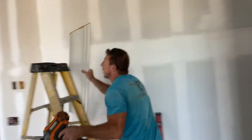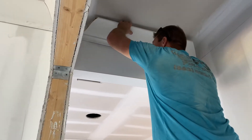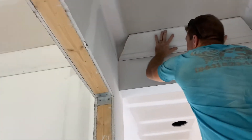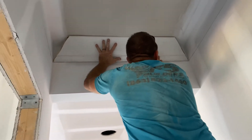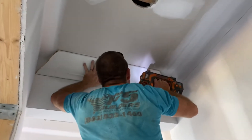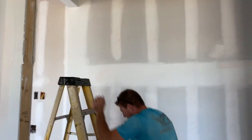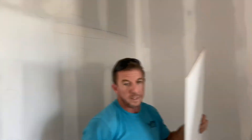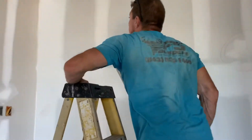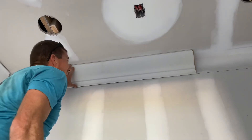We're going to nail this up — let's double check it out. I like to get it nice, right inside the wall here. Now what we want to do is, we've got some pieces cut here. We're going to actually do a seam, because if you were to do a big room and you have walls that are longer than 16 feet, you would need to actually splice them.